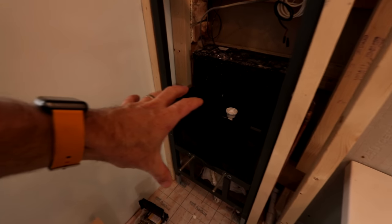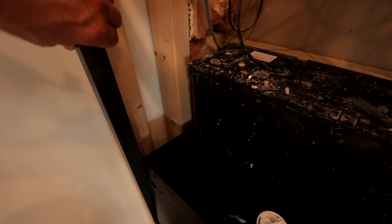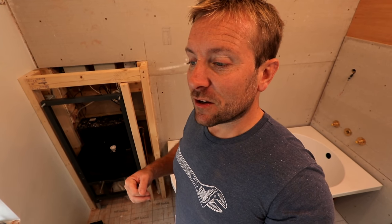So what I need to do is make sure that my cistern height here is actually slightly higher than this one, purely because the one that was attached on there was attached on this frame, and there are some holes at the back, so I know that the top of the water level would have been about here - so it's just a little bit higher up. And what does water level equate? It equates head pressure, which would then also equate the speed at which the flush happens and how strong the flush is. Now remember, when we did the review of the Vitra toilet, we can take out a small insert at the back of the toilet to sort of adjust the flush and all that sort of thing. So we've got a little bit of pipe work to be doing in here now, and you'll be watching us do it in a minute.